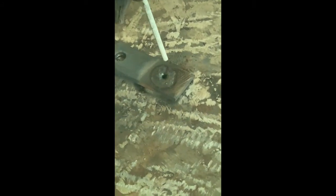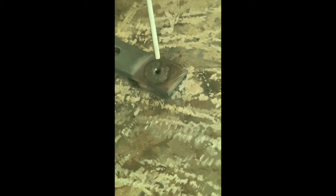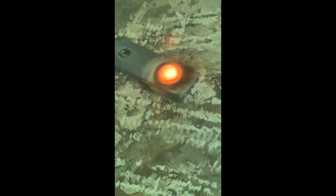Now I'm going to take a second electrode and fill it in. I'm going to start right up here back on my 10:30 position, let that fill in, roll it back around counterclockwise and stop over here, bring it slightly to the center, and you'll see it'll kind of build up a nice little button on top.